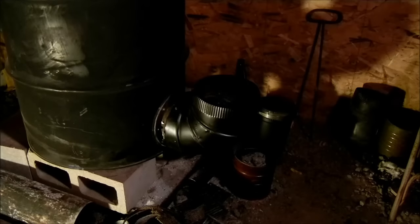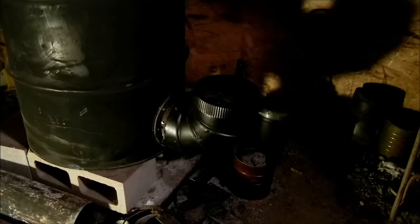So now, gotta fill that up. First I'm gonna find my gloves. I got some gloves out here I've been using for insulation and for this header wrap, so I don't get that stuff all over my hands. So first what I'm gonna do, like I did before, is put this header wrap around. Use these extra bits, and that'll keep it from leaking, because we got all those little cuts. Put this on first, and that way the insulation won't fall out as easy. And it'll insulate this a little bit that otherwise wouldn't be insulated.